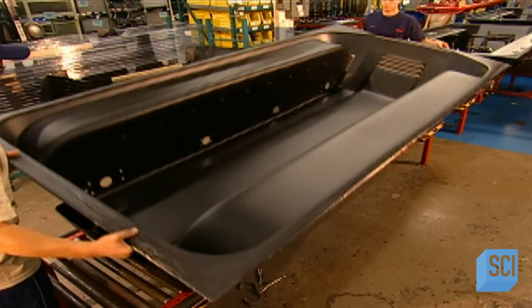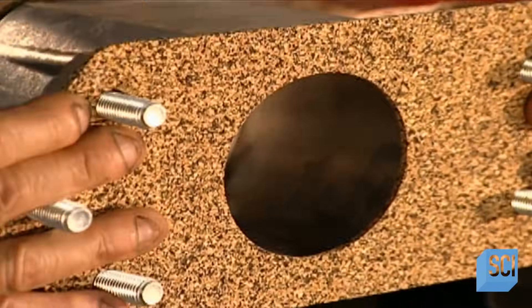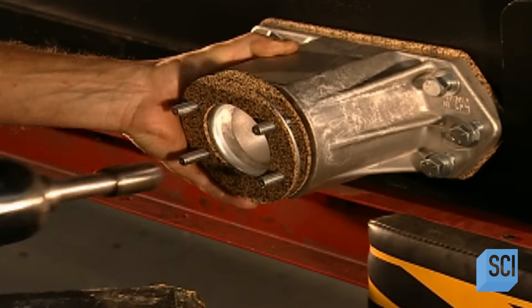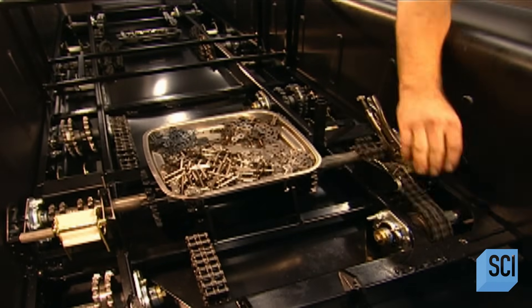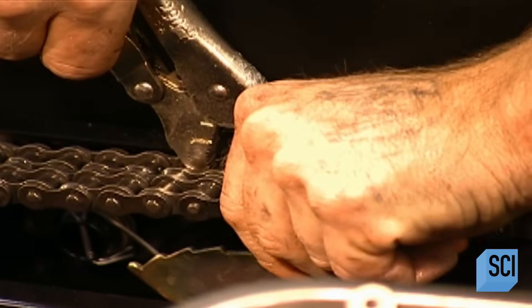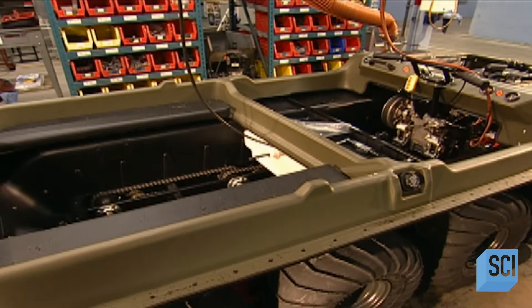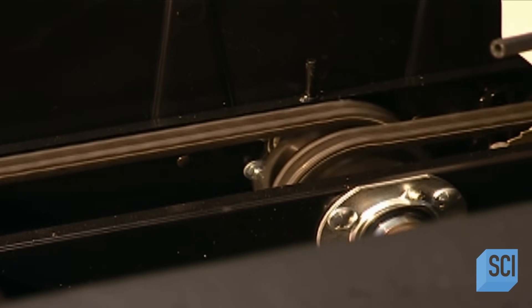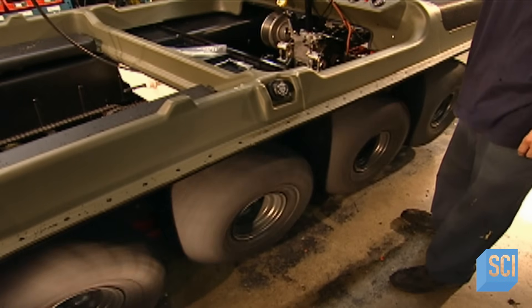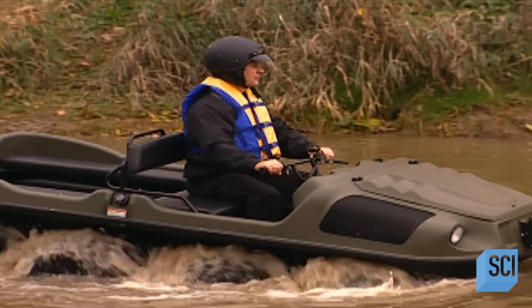Two workers move the lower body to an assembly line and insert the vehicle's mainframe, now painted black. On the outside, they mount four extensions to carry the vehicle's two front and two rear axles, enabling the axles to withstand greater punishment. They install eight drive chains onto sprockets on the axle shafts, then two more linking the transmission to the drive system. Workers lower the 26-horsepower engine into the carriage and attach it with three bolts. They add the polyethylene upper body and the wheels, testing drive chains for tension and sprockets for vibration. The wheels are twice as wide as most car wheels but ten times softer to cushion the ride. On land, this $16,000 vehicle travels up to 21 miles per hour; top speed in the water is only three miles per hour.